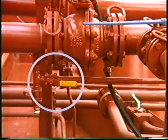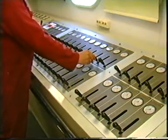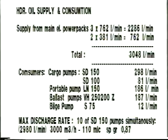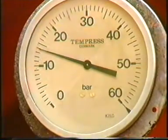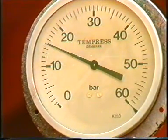4. Follow the same procedure for cargo pump number 2, 3, 4 and onwards. Be sure that enough hydraulic oil is available for the cargo pumps. If not, the cargo pump speed will drop and capacity head will be reduced. 5. The shoreline back pressure will increase when more cargo is pumped through the line.